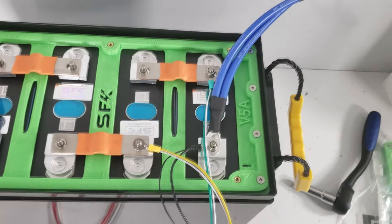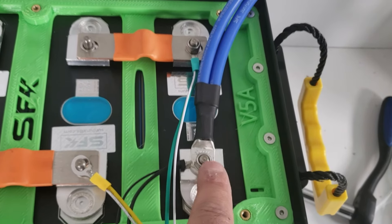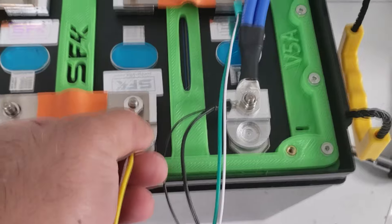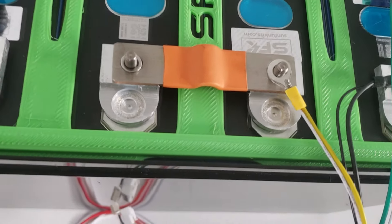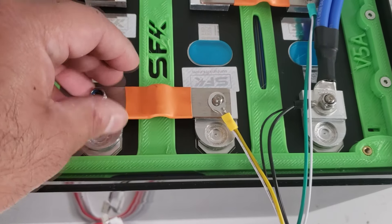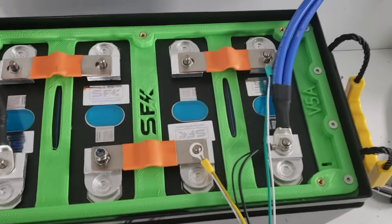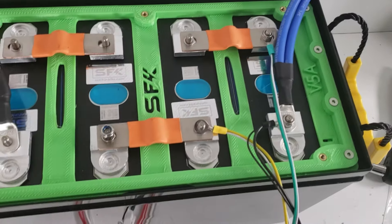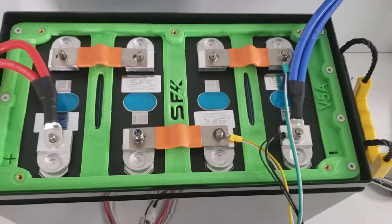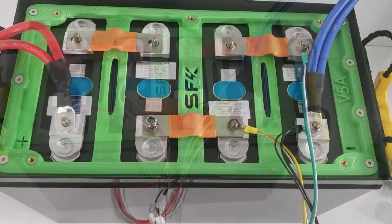The main lug makes contact with the terminal and the black wire sits on top, then snug it down with a lock nut. The terminal goes directly onto the post and is secured with a lock nut. On the other side, put a washer and secure with a lock nut — only on one side. Do not put a washer on the terminal contact side; you want the most direct contact possible with the bus bar or terminal.